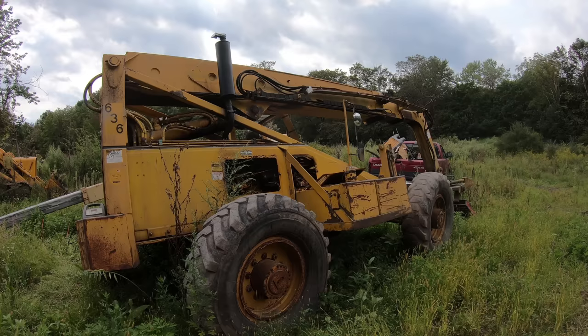And the other cylinder that I really need to fix before I can operate this machine is this one right here. This is a tilt cylinder, and it's leaking so bad that it's squirting a stream like 8 feet out from this one place on it. I've had this strap on it for a year now, and it works fine. It's holding it up, because otherwise it'll just droop down. So I want to take this out and get it fixed. I'm going to try to do it myself. It's a much smaller cylinder with a much smaller rod in it. The piston's just as big as the other one, but the rod is a lot smaller. I don't know if that makes any difference, but I'm going to try.